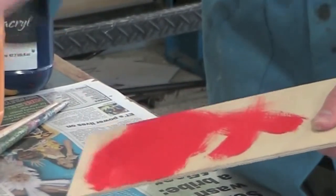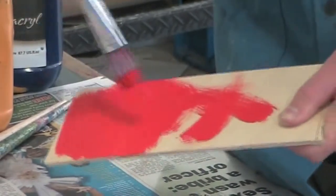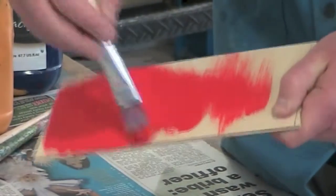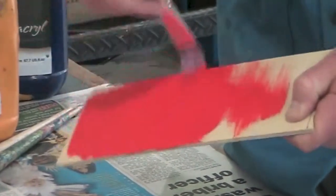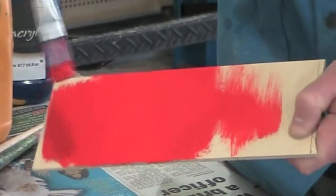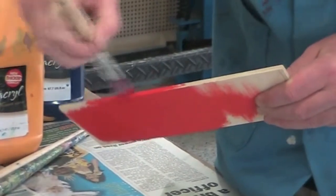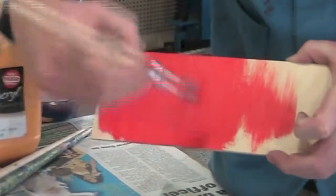As well, if you put way too much paint on one section, it'll take a very long time to dry and it will bring up a bit of a raised surface. Also, if you don't put enough paint on a section, it's going to start to show the timber through. So it's trying to get that balance of having a nice even coat all the way over your timber. So you can see that middle section is quite nice there. And then we've gone a little bit light down there, but that's okay because this is our test piece. And then you'd also want to just grab a little bit and do your edges on the top there. There you can see. And so that's sort of what a nice finished piece of timber would be.